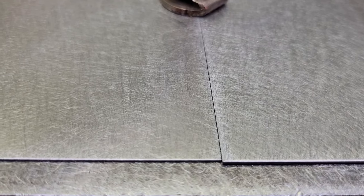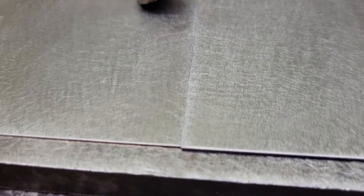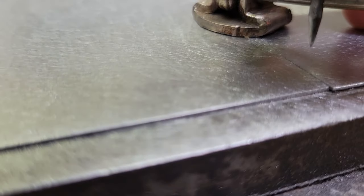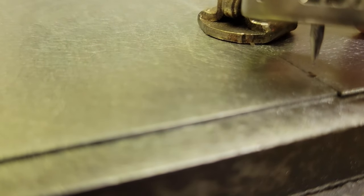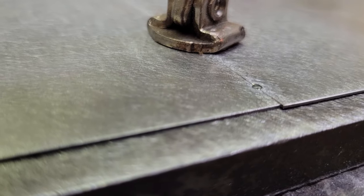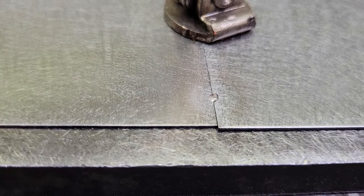And it's at 28 amps. I'm going to go in there and floor it at 28, and I guess I was trying to be a little hot on it, heavy footed, so I'm going to clamp it down here. You can see where it's up a little bit. All right, here we go. There we go. That's a good looking fusion tack right there. So let's get us another one up here.